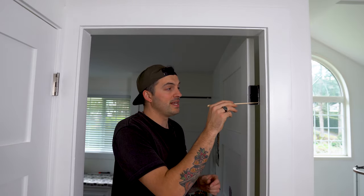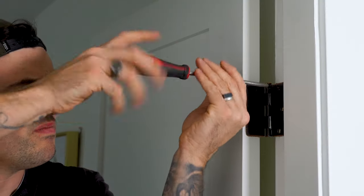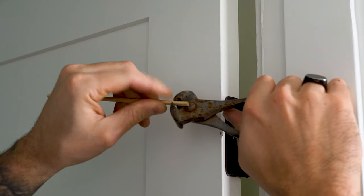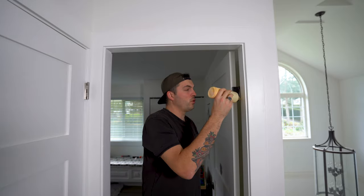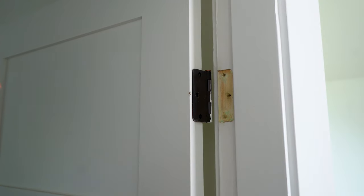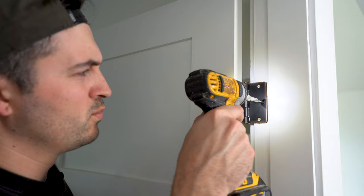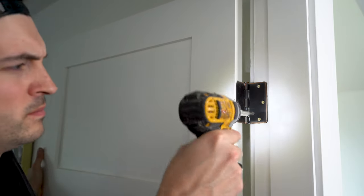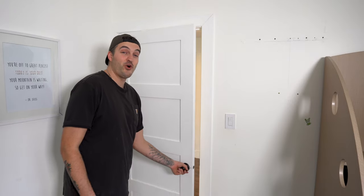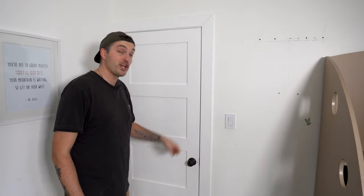This is a great quick fix, but for a more permanent solution you'll need something like a kebab stick, a chopstick, or even a wooden golf tee — something the same size as the holes so you can really plug them up. Take off the door or the hinge completely, cut your piece of wood to the depth of the hole, add wood glue in all the holes, and tap in the pieces of wood until they're flush. Once the glue has dried, put the hinge back, re-countersink your new hole, and put the screws back into the original position. The door will be closing like an absolute dream.